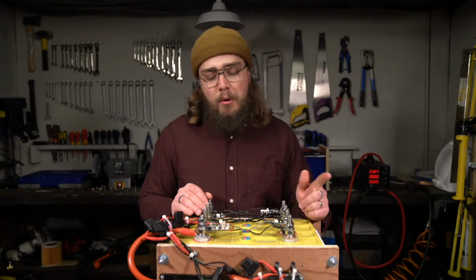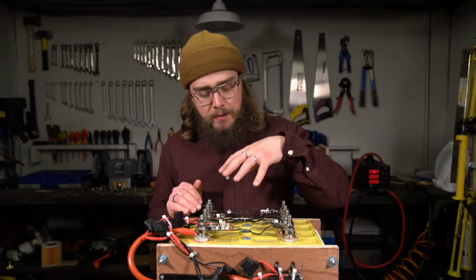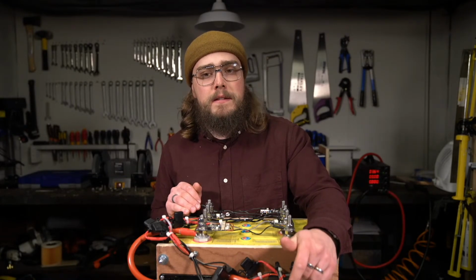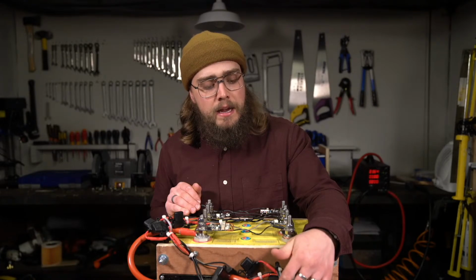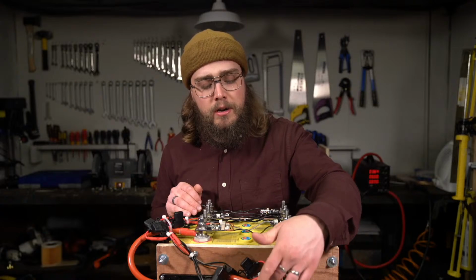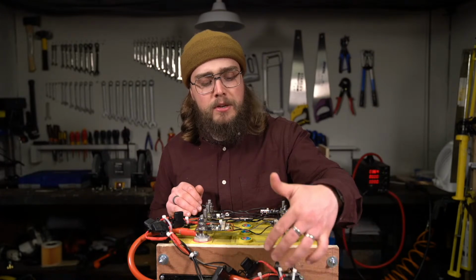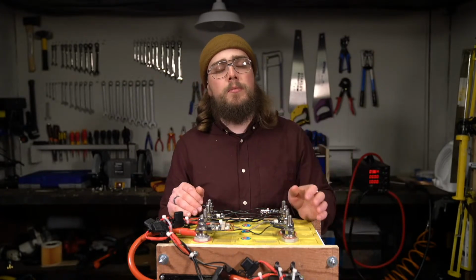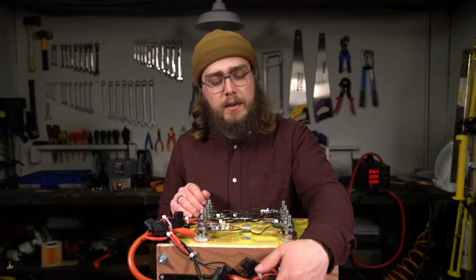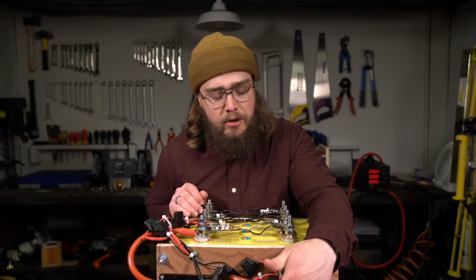So I definitely wouldn't recommend it to somebody that's a beginner, but it is very functionally rich and has a lot of functionality. Probably the biggest drawback with it though is the fact that the BMS relies on these relays here on the front that you can see. So you have two lines coming in here, your charge and your load, and it can turn off your charge and your load independently. So if the battery is being overcharged, it can just turn that relay off, stop the charge coming in, but still let the load go out. So that's where it is pretty good.